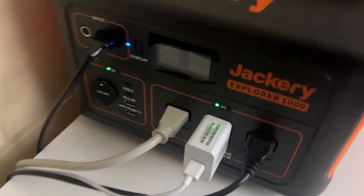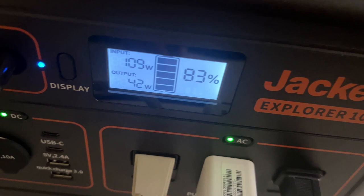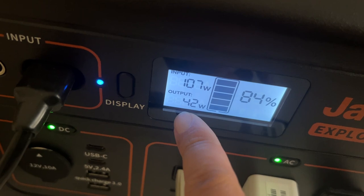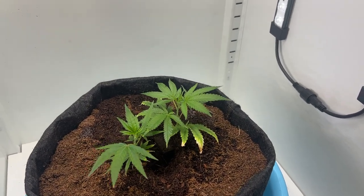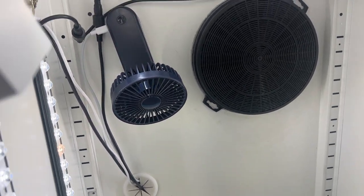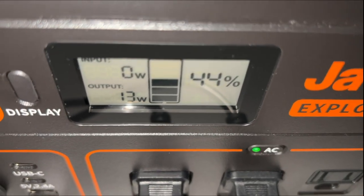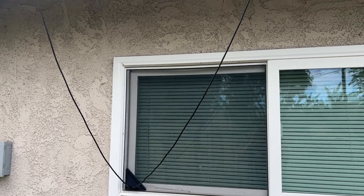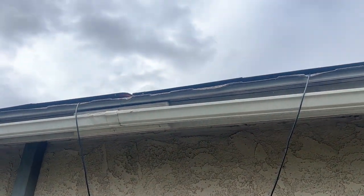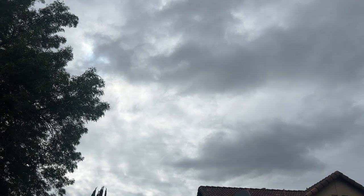The battery, on the other hand, worked great. But the problem is that it just doesn't hold enough wattage. I originally figured that as long as I was running my devices mainly during the day, it'll barely have to run on battery power, and only when the sun goes down for a couple of hours, which means it should never get too low. However, I never considered that the system might just not generate any energy, like for the two days that it rained. To stay completely off grid, I had to dim the lights down to the lowest setting until I was able to get the panels back up. The rain wasn't the only issue — there was a week where every day was super gloomy, which meant I only generated like 500 watts a day. During that long stretch, I had to dim my lights down as well to stay completely off grid.